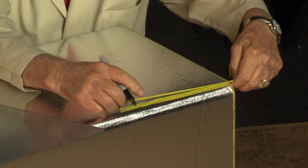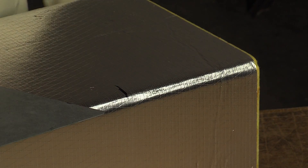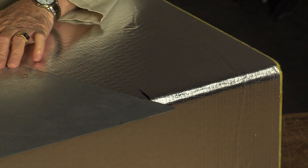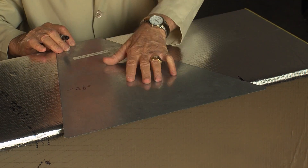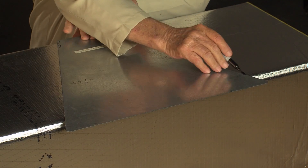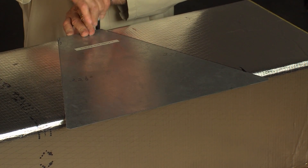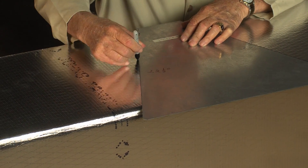I'm going to come in nine inches and start the fitting. Put a mark right there. Then I get this template set in place and hold it over here on this side and draw a line from that side of the duct back across to here. Leave four inches and come back across the duct this way.